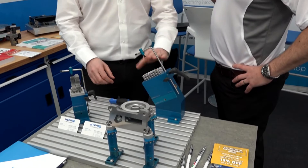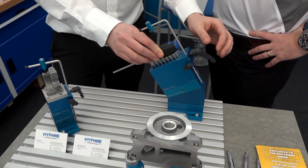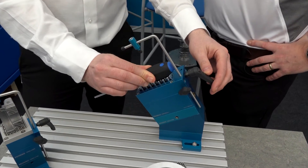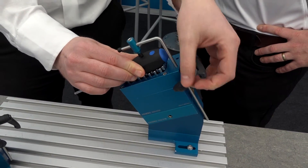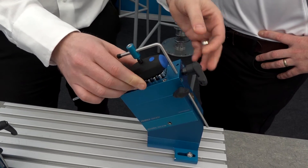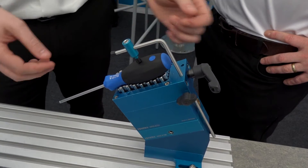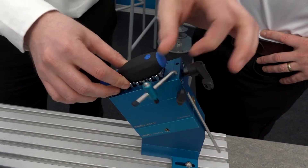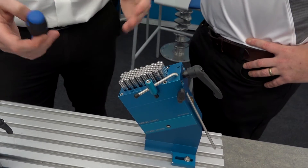So the way it works, you've got spring pins. You have these set up around your CMM area, so your component goes on top. Once you've got your form locks in place — this one we've got a work stop because it's on an angle — as soon as it's in place then you can come around and do your measuring. When you then need to change over a part, if the part is different, all you've got to do is pins back up and away you go again.